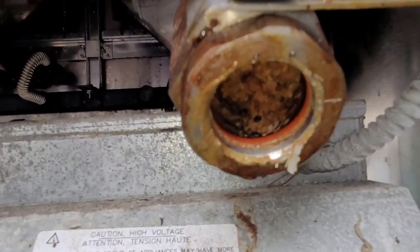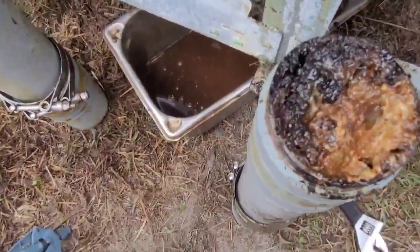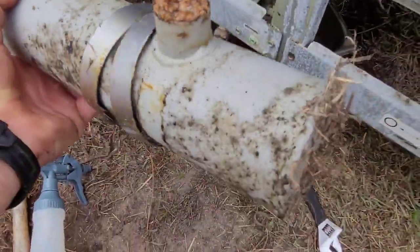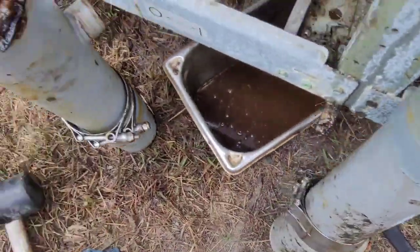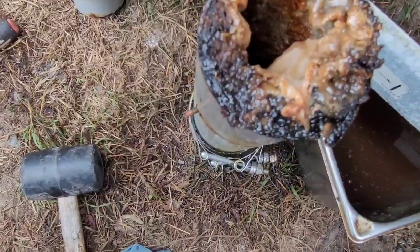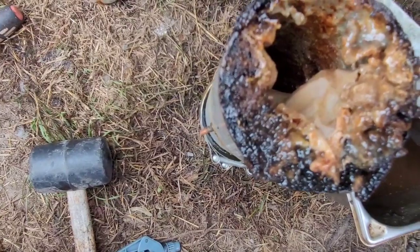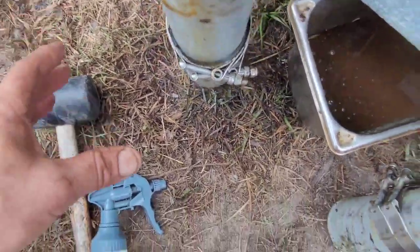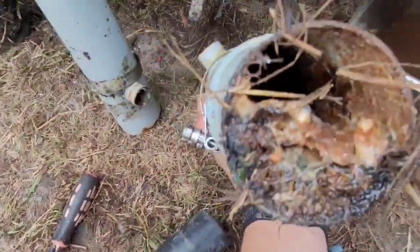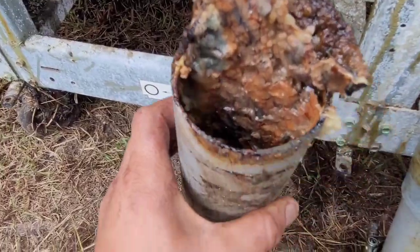As you can see, the valves are clogged in all of them — look at this. This is what happens when you filter and just drain your oil without leaving the valve open for at least 90 seconds to two minutes. The debris starts to build up like this, and it gets worse and worse until you cannot drain your oil anymore. Then it becomes a big mess to fix.